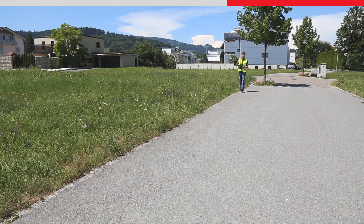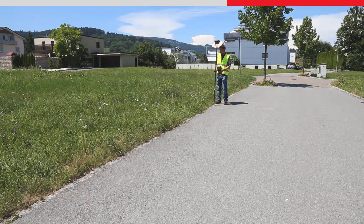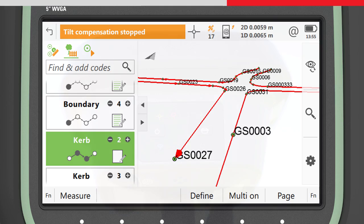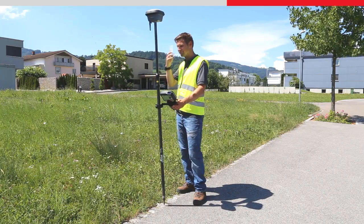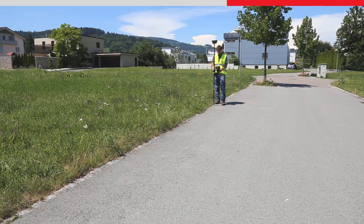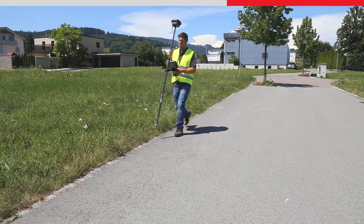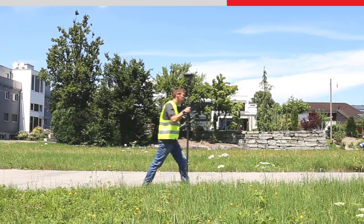As you move about during the survey, the normal movement ensures that the GS18T continues providing a tilt compensated position. If the GS18T sensor stops moving for more than about half a minute or so, the tilt compensation will be stopped. This is shown by the position icon in Leica Captivate losing the green bubble, and the tilt indicator will also switch to red. If you now want to measure a point, there is no need to change any settings — simply level the pole to vertical using the standard pole bubble and measure the point. To start the tilt compensation again, all that is needed is to walk to the next point to be measured.